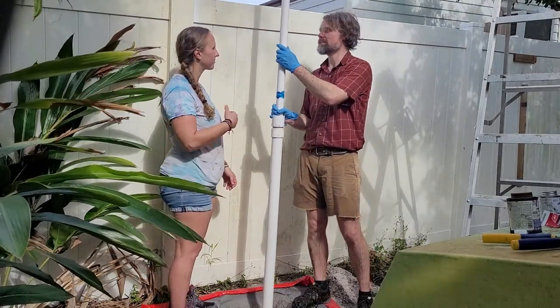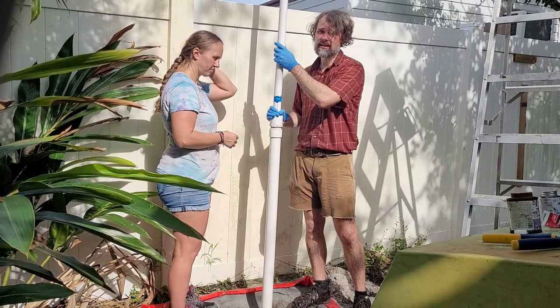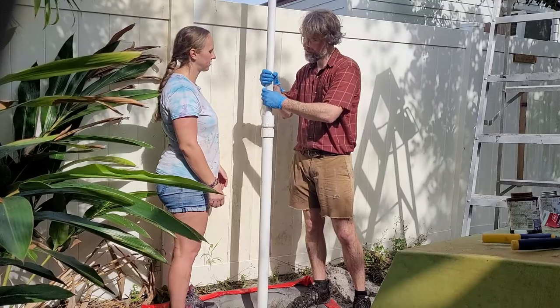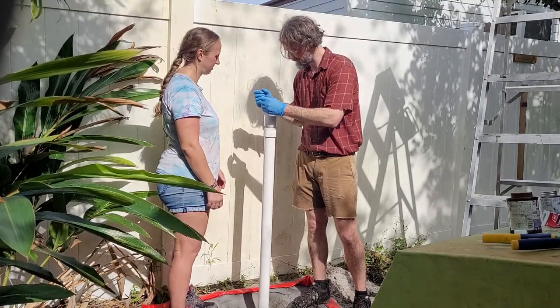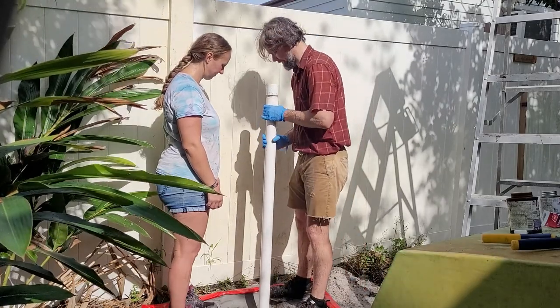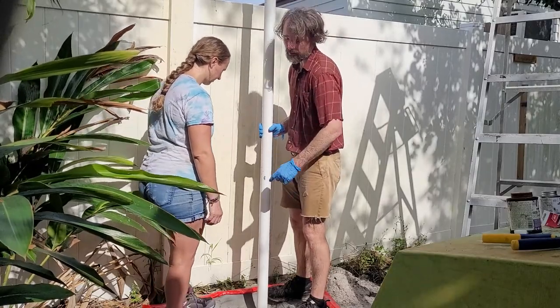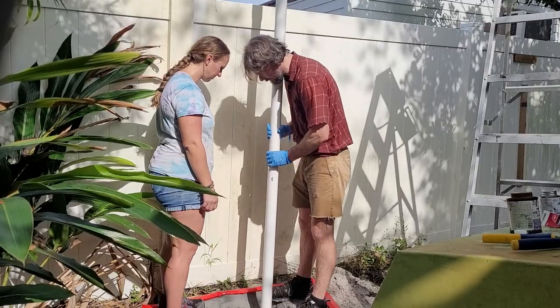Okay, this is good. So glue up your joint, let it set up, and then just drop it the rest of the way down your shaft. All right, and then slowly back out your 2-inch pipe, making sure you don't pull the 1 1/4 out, because the sand's going to collapse around it and it'll hold it in place, but you'll have a big hole for a while.